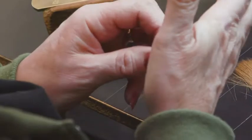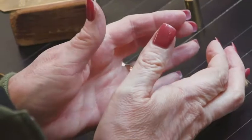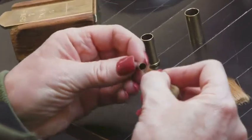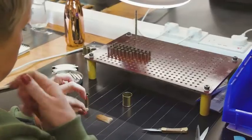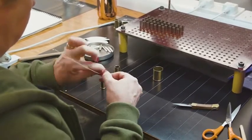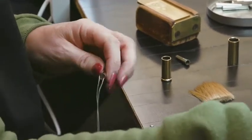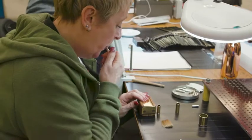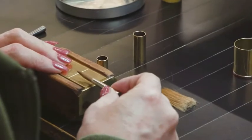When the hairs are all sorted, they're ready to go into the cannon. The bundle is tied together and gently twisted through. Individual hairs are added or taken away until it's an exact fit. They need to have that fine point to work with, that basically it has that colour carrying capacity, that the brush won't split or do anything that it shouldn't do. Through the hair that we use, through the skills of our makers and how they make them, we've done everything we possibly can to make sure that we have produced the best product we possibly can.